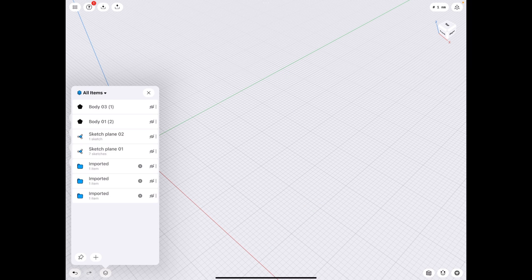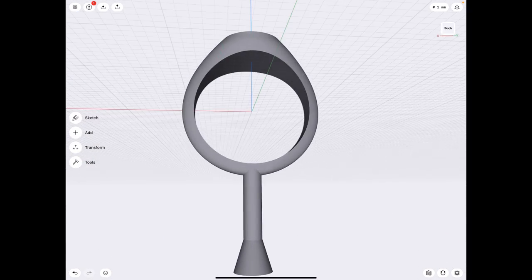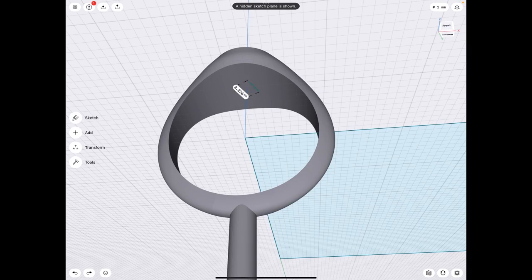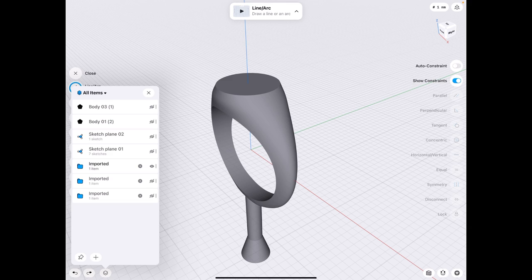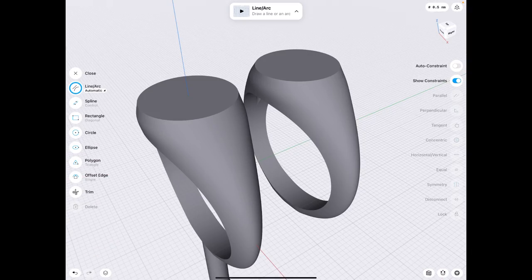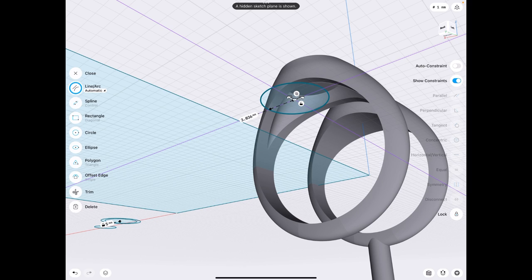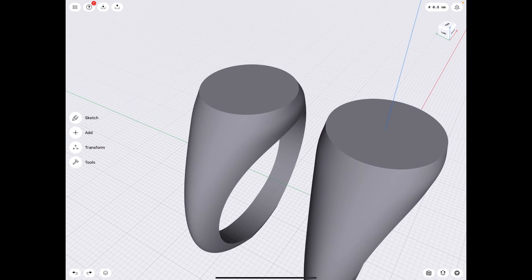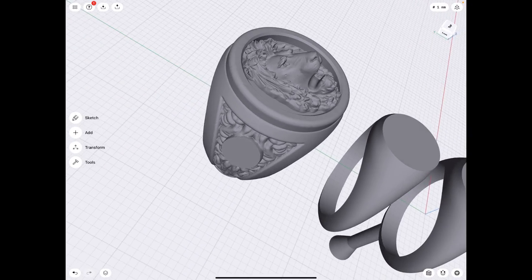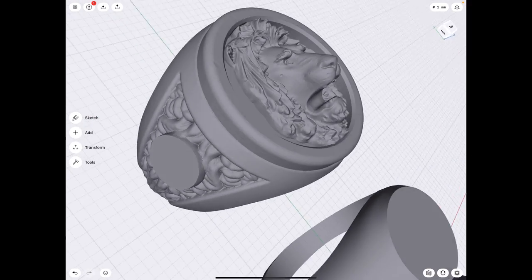First of all, we need the design. Let's get rid of these and bring up a model. This is the model I used — it has a sprue attached, but overall it's very simple with no hollowing on the inside. We have another option as well: one that's virtually identical except it's been hollowed on the inside. When it comes to getting the injection wax out of the mold, any little overhangs can become a problem if the resin isn't flexible enough.